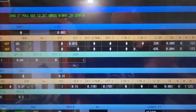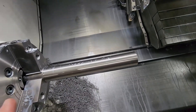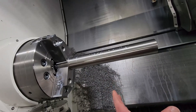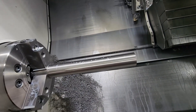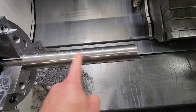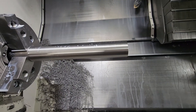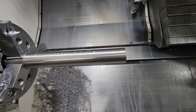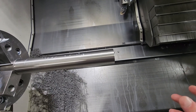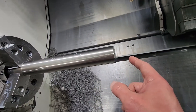Pretty much what I'm doing — the thing is, I'm using the tailstock because the part sticks out technically about 12 inches, which is pretty far. There's no way you can actually turn it without any chatter. There's just not enough rigidity based on that. The part is about 2 inches in diameter and we're cutting it down another eighth of an inch. So I do face it and put it in the center.